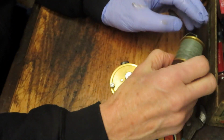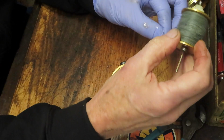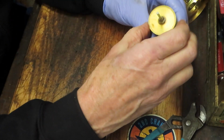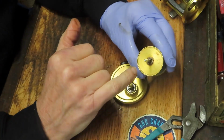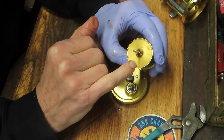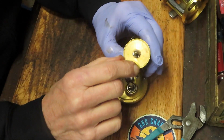So what's the lesson learned with this one? The lesson learned here is to not jump to conclusions. He said he had heard something funky, and with that he had assumed that something broke, and didn't even bother to try and check out underneath here. The other lesson is to service this one in due course, like once a year. You'll avoid something like this frozen bearing here.